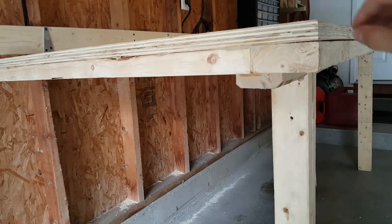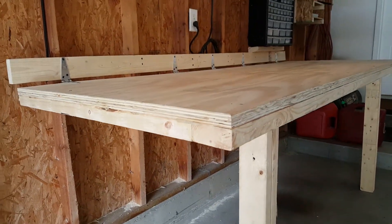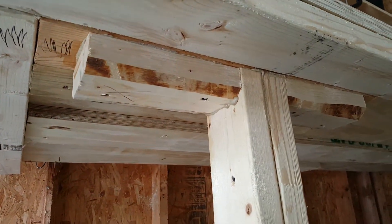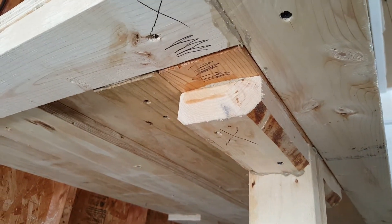For the surface, I went with two half-inch sheets of plywood — it's easier to carry and even more rigid glued and screwed with construction adhesive. I nearly went with full four-by-eight sheets but did rip off about eight inches. You can see this fixed to the bottom of the bench surface here for extra strength.